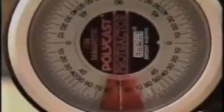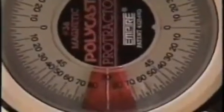On a straight run, it should be 90 degrees. On an outward curve, angle it 2 to 3 degrees away from the pool, and on an inward curve, angle it 2 to 3 degrees towards the pool. Once you've adjusted the guide lock, begin drilling. Remember to always wear protective eyewear when drilling.